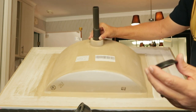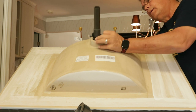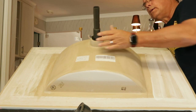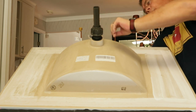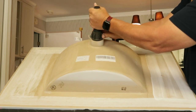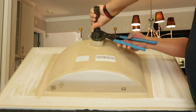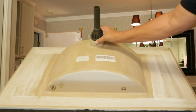Now you want to put your cone washer down with the cone facing towards the sink. Pull it out around that lip and then push it down in place — that's going to hold it there. Go ahead and get the nut and tighten down on that cone washer — that's going to give us a good seal under the sink. Last thing we want is leaks. Get your trusty 12-inch plumber's pliers. Don't over-tighten, but snug it up to the point where you're sure the seal is made.